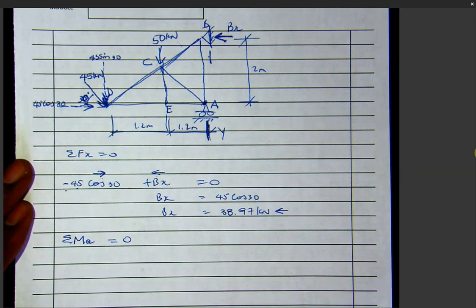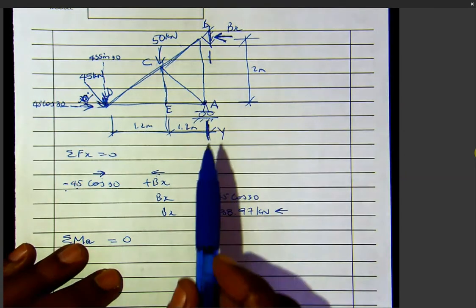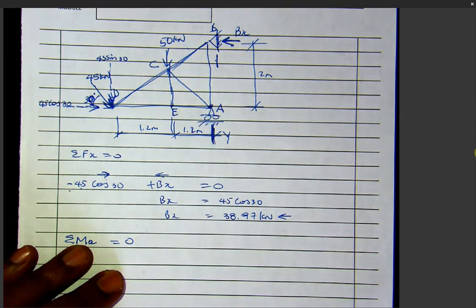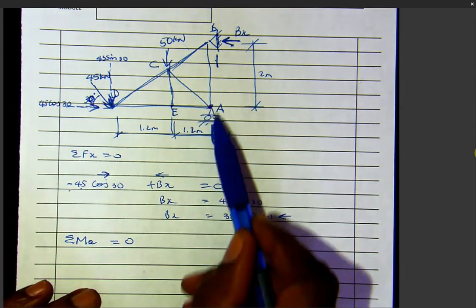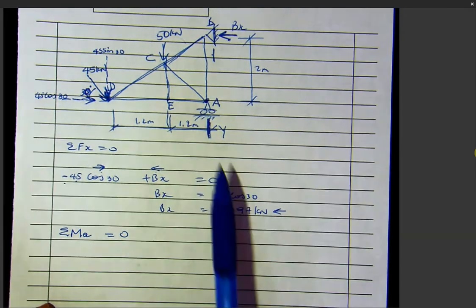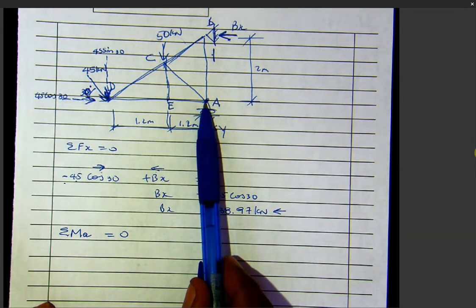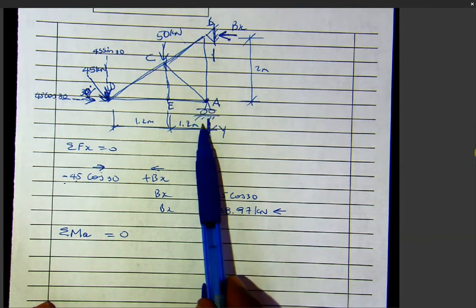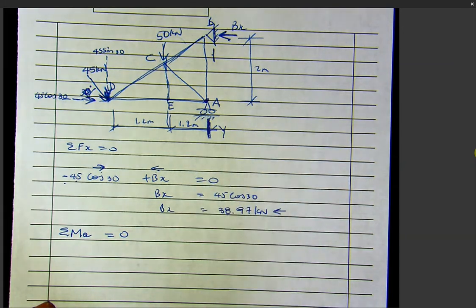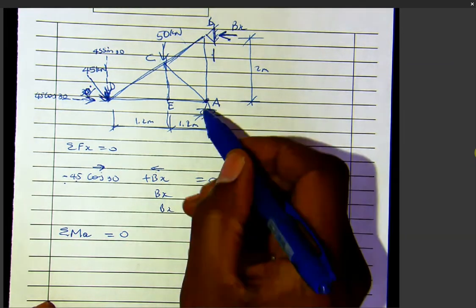It's out. Then we have a problem. That means my orientation, this orientation is wrong. Because if I'm taking moments about this, I'm cancelling this too, and there's no other point that I can take moments about when it comes to this. So the orientation between these two reactions, this one I must change to a vertical roller. So please forgive me for that.